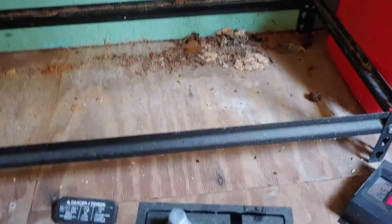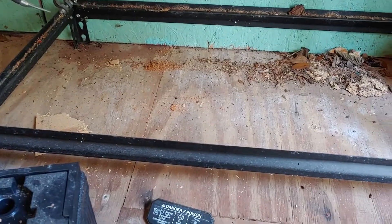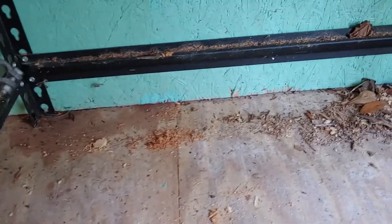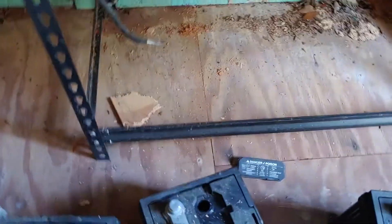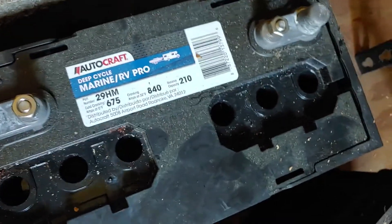Then I'm going to decide — I may put another stronger board in there. I do have some, or maybe I'll just lay them on the floor if my connections are long enough. Each battery has to be connected to another battery to keep it within the battery bank. We do them all in parallel here — keeps the same voltage but raises the amperage. Mine is a 12 volt system. Even with people that do solar all the time, disasters do strike, and this is one of them.